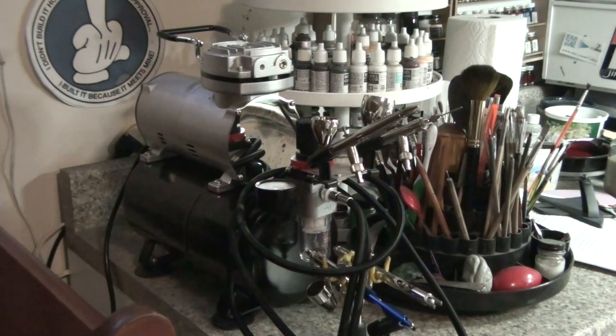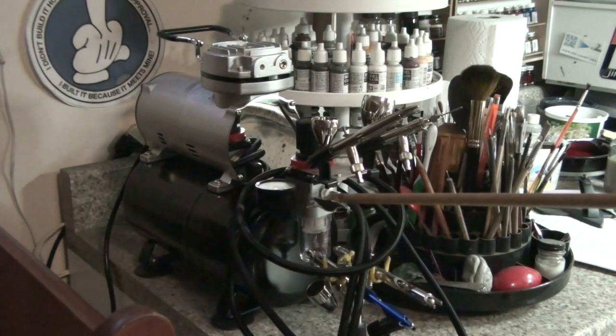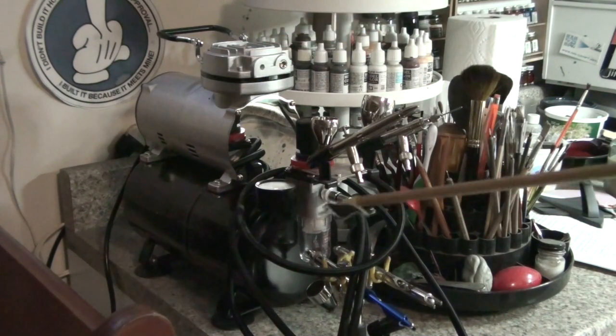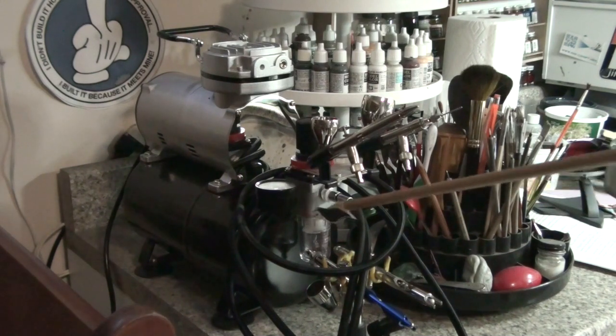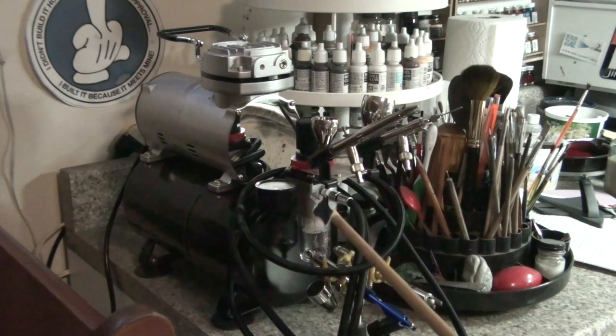The best thing you can get for consistent, dry airflow is one like this — one with a reserve tank. You need the pump at the top and the reserve tank; that way you get consistent airflow and moisture control. The moisture trap is that gizmo — this thing here, it's a bottle that hangs at the bottom of the regulator. Air comes out of your compressor, comes in here, and moisture is extracted through condensation and drops down into this little reservoir, so it takes the water out of the airflow. You get dry air — at least that's the hope. You need a compressor with one of these that's good enough to do that, and you also need one with a fairly accurate regulator.